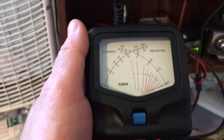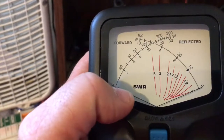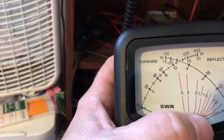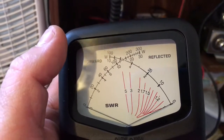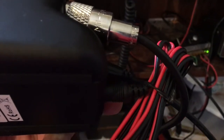I wasn't getting too confident with my Radio Shack CB, which was working okay. In case you've never used one, I just learned about these crosshairs — you have the reflective power this way, reflective watts over here, and forward power this way. When the two crosshair points cross over, they give you the SWR reading. I was getting a kind of high one with the Radio Shack, and this one's giving me pretty much a one-to-one reading at 28,400. It does have a power outlet, but you don't need it — it's only for the backlight.